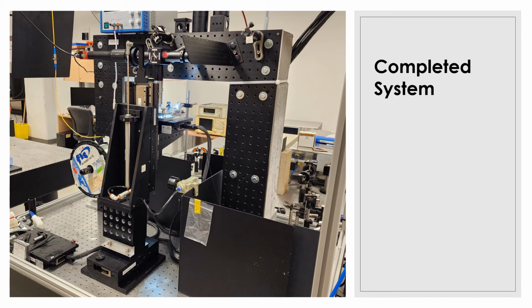So this part here, the actual beam turning optics would stay fixed. And what we would actually move up and down is this objective lens. So the objective lens then traverses in and out. And this would be very useful because it'll allow us to fix all of this, and this x-axis and then this y-axis can be put together instead of being separate. Right now they're quite far apart, and there's a lot of mass in this z-axis still.